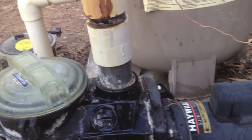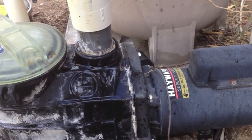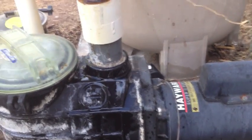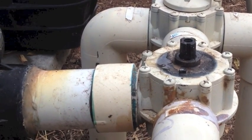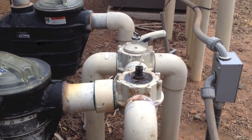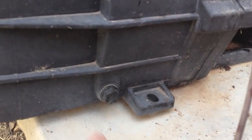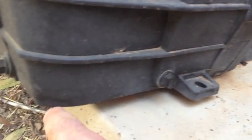Here's an example of a pump suffering leaks on the pressure side. Now on to the air leaks. One trick you can use is switching the pump on and off. A sudden change in pressure will usually cause water to squirt out from the culprit spot and may reveal faulty o-rings or even a cracked strainer lid. If the pump won't prime, you'll need to pressurize the line with a rag and a garden hose through the back hole on the skimmer with the pump shut off. Don't forget to check the plugs at the bottom of the pump as well.